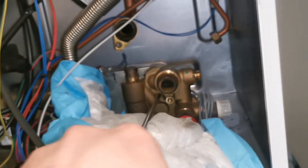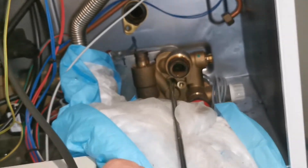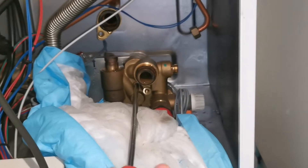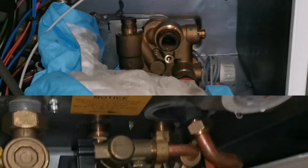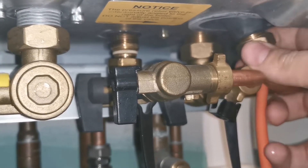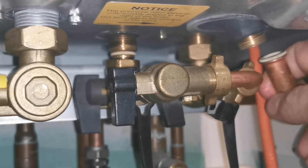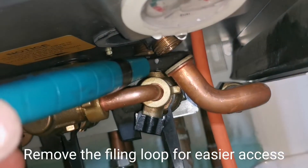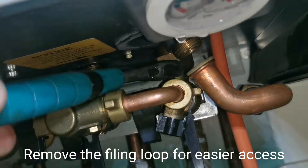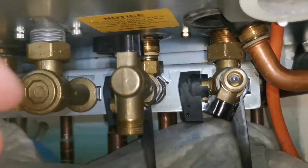Over there you can see I'm using pads. They hold about 1.5 litres of water, so they're a lot better than using rags, and on this occasion it just protects the PCB. So there you go — undo one screw which holds onto the plate heat exchanger, then undo the nut that holds the PRV in, and that one's out of the way. For easy access you could just move that filling loop out of the way, which I should have done in the first place.